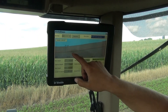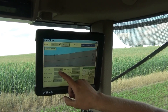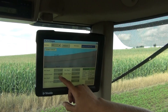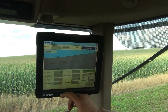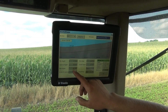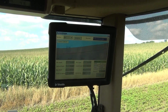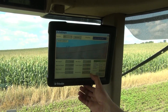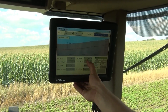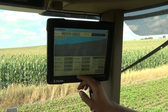The green line is the proposed tile. The red line is our minimum depth, programmed in at 3 foot. We've got an optimal depth of 3 foot 6 inches, which it'll try to hold as much as it can. Maximum depth is set at 6 foot. We're using a 7 foot plow, but it will allow us to make designs 6 foot deep and no more.